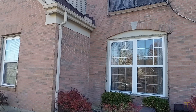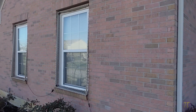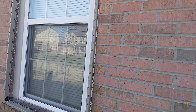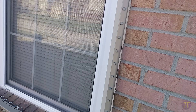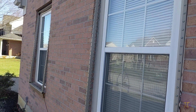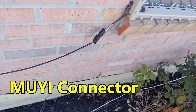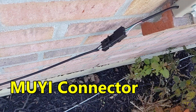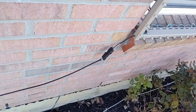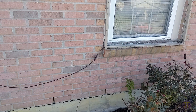Next up are the window outline frames. The frames all consist of 5-volt bullet pixels chained together, and a power injection line runs parallel to the lights to provide power for every 100 pixels. The frames are also made out of J-channel like the roofline. I had difficulty drilling parallel holes into the PVC and keeping the holes straight. While they do work and match the house color, a PVC frame would have been sturdier. Each connection between the frames uses a cheap waterproof connector called a Mui connector.